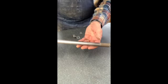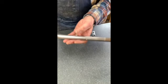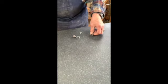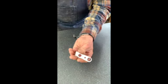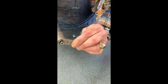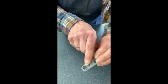And what happens is, when you try to run material through the sander, it hits this on the outfeed side and it doesn't want to raise up. So we're going to try and fix that. The other problem is that this is the bracket that the roller shaft mounts in. It goes in like so. And as you can see, the slop in that is just awful. And look at how it's been all hogged out.